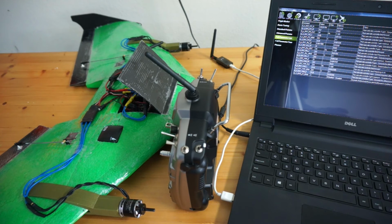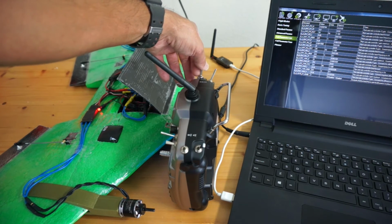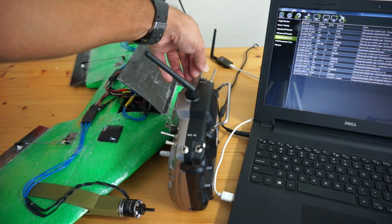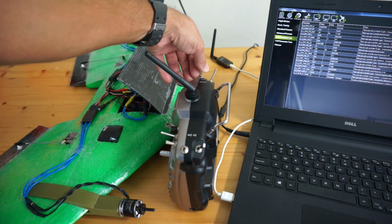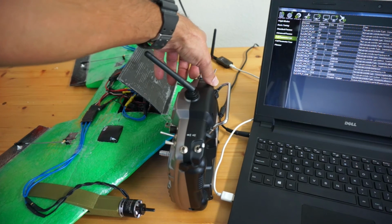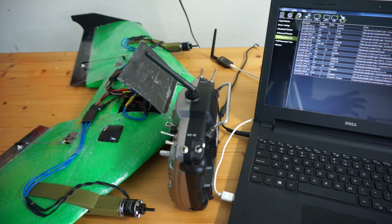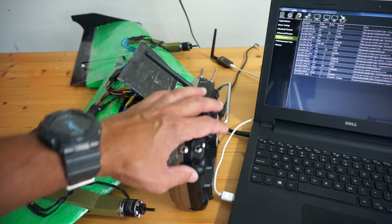So let's say that you want to abort or revert your settings. What I can do is I can toggle out of this flight mode. Right now I'm currently in Q hover. Let me just toggle out, and that will cancel any of our current configuration. So we hear Mission Planner tell us tuning reverted. I'll go back. So that's how you would revert, or you could land, unplug, and none of those settings would be saved. Now let's actually go through saving those.